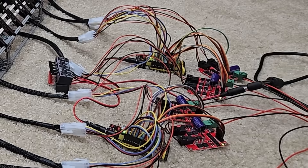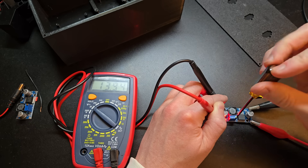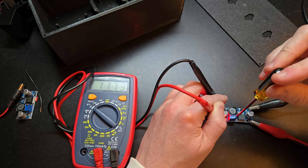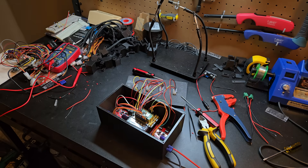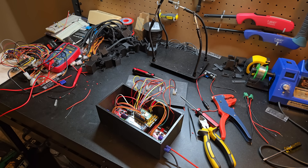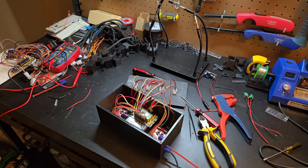I did forget how to make the launch work, but I knew the next step was to take the mess of wires and put them into a box. I wanted to power the entire box from one source, so I bought these buck converters to take the 24-volt supply power down to 12 volts for my Pico daughter boards. This is the very first box I've built and I'm going to be powering it on for the very first time, so if it lights on fire, I figured I might as well get it on video. Power on in three, two, one. No smoke — sorry, guys.